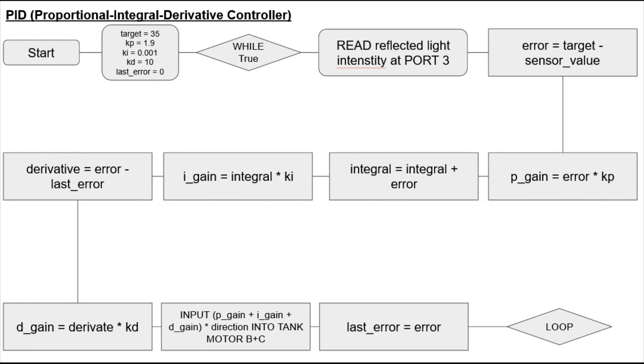Next, I will be explaining the integral part of the PID algorithm. Ki will be the proportionality constant of the integral part of the controller. The general formula for the integral calculation is: integral equals integral plus error. From here, turn equals kp times error plus ki times integral. An example is such that if the loop proceeds and the error remains positive, the integral will increase over time. This contributes to small corrections since the turn will be tweaked through small adjustments with the changing ki integral value.